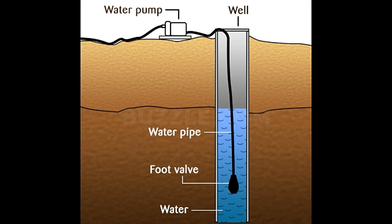As shown, the foot valve is installed at the pickup end of the pipe, which is the end that goes into the water well, and through which water is sucked. Thus, it is located at the very bottom foot of the well, and so it isn't easily visible for studying. When the water pump is running, suction is created, which pulls the water in the upward direction through the pipe. The foot valve is so designed that it opens up easily because of the upward pressure from the incoming water, and thus, normal water flow through the pipe is established. This is shown in the image below.